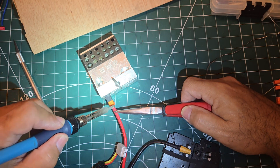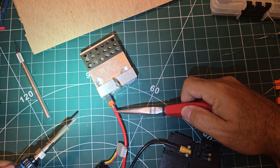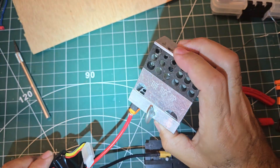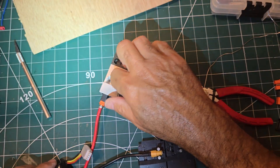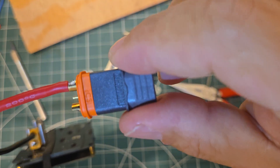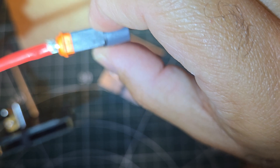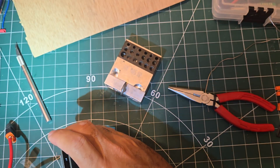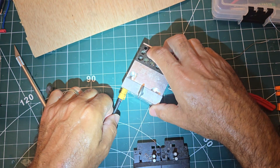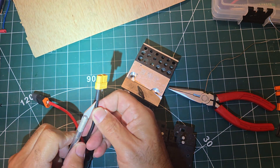Make sure you have a nice continuous pool of solder across the joint. Just take your iron and rub around to make sure you see a nice smooth puddle. Some solders end up hazing and some shine — I prefer the ones that shine. I got a decent joint, not the best I've ever done, and the solder that was on there is the hazy stuff — I feel like hazy solder doesn't give me the best results.